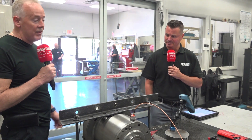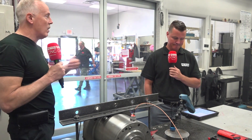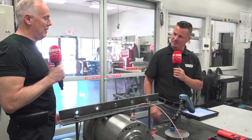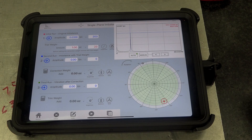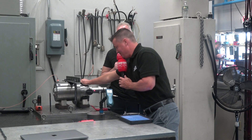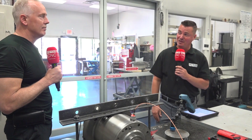This one we're going to be going about 7,000 RPM — not slow by any means, but not as fast as our 20,000–30,000 RPM spindles. There's a graph showing when it's up to speed, and you're seeing a peak — that's our running speed peak with the cursor on top. You're also seeing a polar plot on the bottom showing where the heavy spot is. It definitely looks out of balance currently. Put your hand on it carefully — you can feel that vibration. If I'm running a cutting tool right now, I'm definitely losing tool life and creating a poor finish.